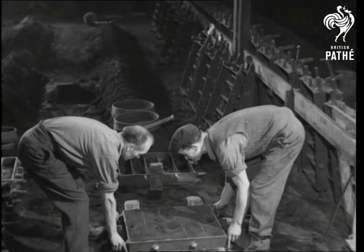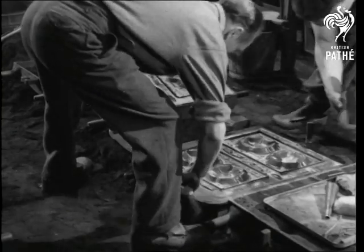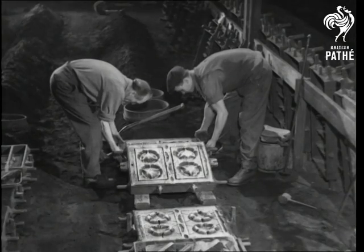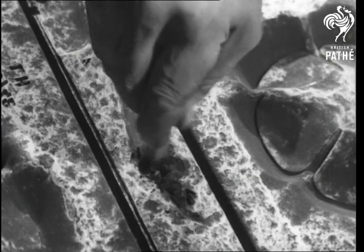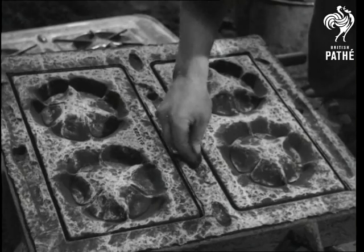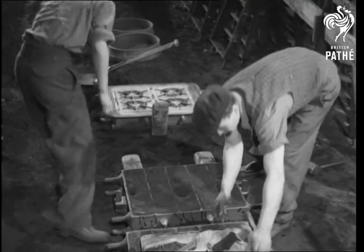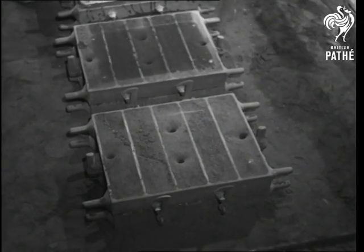The top half of the box, complete with sand, is now taken off, leaving the pattern plate on the lower half. This plate is brushed, tapped to loosen it, and then carefully removed and placed on the half of another box ready for making the next mould. The inside ends of the holes are cleaned so that the molten metal will run down freely. Packed tight in the box, moulding sand keeps its shape in both halves. Any loose sand is blown away with hand bellows. The top half of the box is replaced. Within this box now is a space left by the pattern plate — connected to the outside by the holes. The mould is finished.